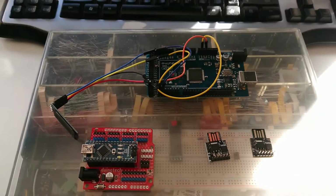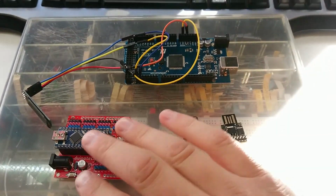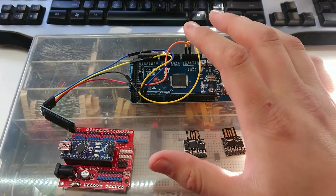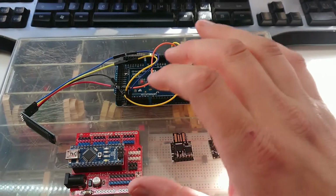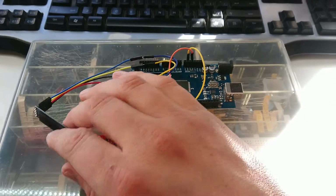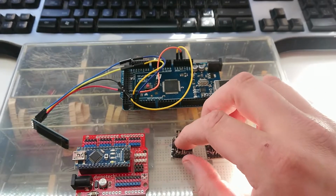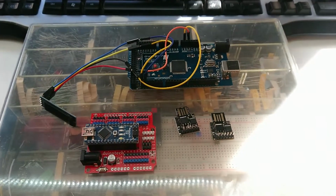Okay, well I'm now at the point in which I've tried many different iterations of Digisparks and whatnot. These OLED displays work quite well. The solution I came up with to get everything to fit was, at the suggestion of the Arduino forums, to reduce some of the unnecessary characters in the font. Now that worked, but something I'm doing when I edit the font causes some weird display anomalies here. It looks a bit like white noise. I'll see if I can get that to demonstrate for the camera shortly. But at this point, this is going to become a two-parter.